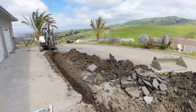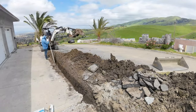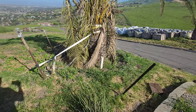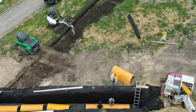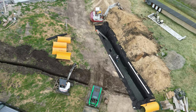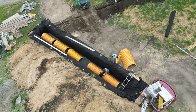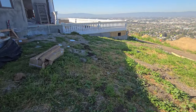We're going to make a saw cut in the asphalt. It's going to come all over here, come out here, and go straight down — pretty much right where that wood starts. It's going to be 45 feet long, about five feet wide — another biodetention catch basin, whatever you want to call it.